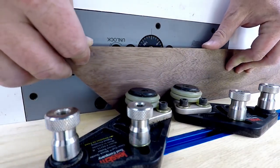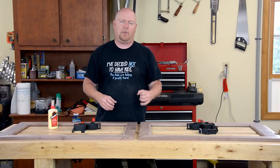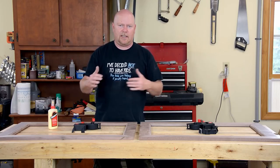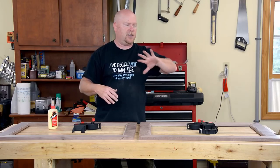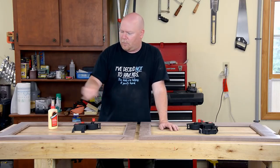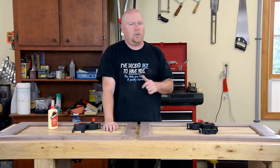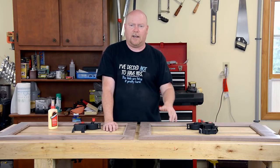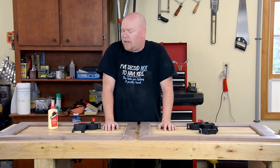Have I mentioned I love these Jessem guides. I've got these things laid out on the bench and I'm ready for glue up, but I'm taking one last look to make sure I got the sides and the tops oriented the way I want — that they match each other and match the face frame they're going to go against. I'm also eyeballing the profile I routed on here, because it's next to impossible to go back and route more on the inside of this frame. Certainly anything decorative — you'd have to clean it up with a chisel.